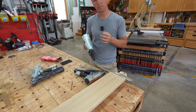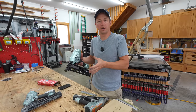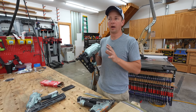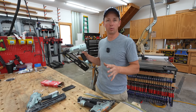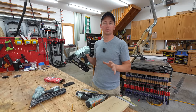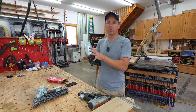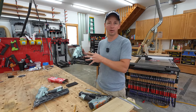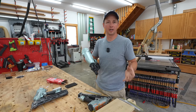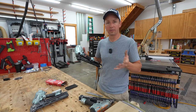On my old gun I actually had it filed down even smaller — I didn't go quite that small this time around. But we want to be able to angle the gun a little and still drive the nail just fine — that's where this modification is key. It allows all your nail holes to look the same size as the nail head, which looks really professional. If I walk into a house and see trim blasted onto the wall with a bunch of wide nail holes, it drives me absolutely insane. As professionals making a half million holes per nail gun over four years, let's take the 10 minutes to make this modification so those holes can be as small as possible.